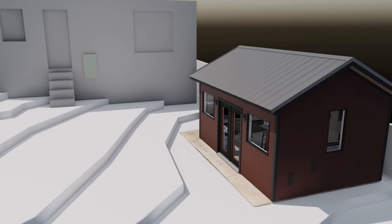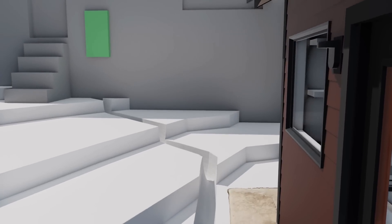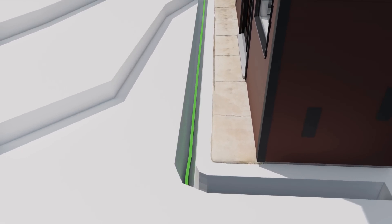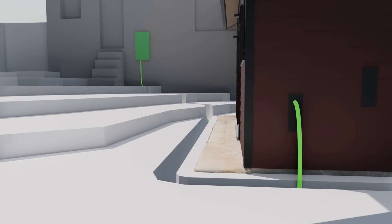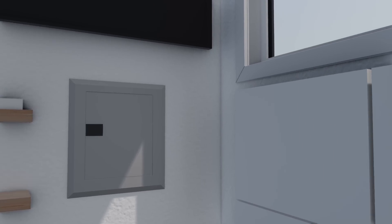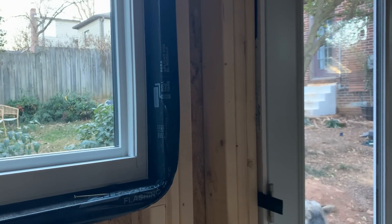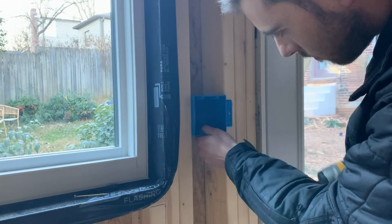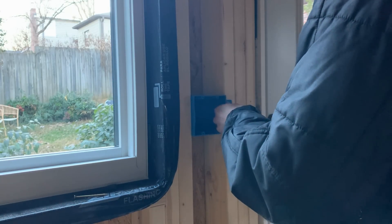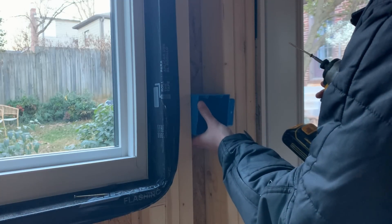Lastly we have our mini split which will have its own dedicated 20 amp circuit. Everything discussed so far will terminate in a subpanel located inside of the workshop. This box is fed from the main panel on the back of my house and I'll wrap my buried conduit out and around this walkway in order to bring the lines in on the far wall of the shop. This subpanel will be right inside from where the conduit enters the wall and it will be located right below that eventual TV. I'm not a licensed electrician but fortunately my county allows homeowners the ability to perform their own electrical work provided they take responsibility for permitting and inspections. I passed both my rough and final inspections related to all the work I'm going to be showing in this video, but it's still important to do your own research and only use this experience as a reference.